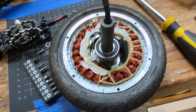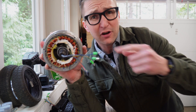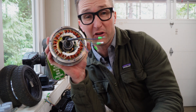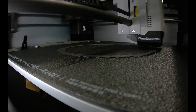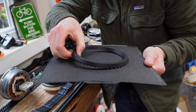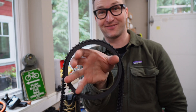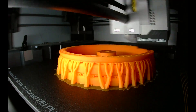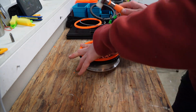Got the cover off — you can see the inside of the motor, which looks pretty cool. Now with the tires off, it's time to make a ring with gear teeth that will interface with the tracks, because these motors are going to drive the tracks on the self-hiking boots. I got to my CAD program and got something ready for the 3D printer. We got our drive ring, we got our track — that is a perfect fit. Very satisfying. I then designed bearing holders along with other non-motorized wheels for the track, cut aluminum extrusion to length, assembled the track pieces, pressed the bearings into the bearing holders, and tapped the drive rings onto the motor casing.